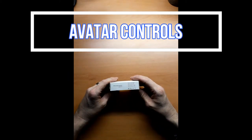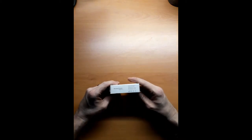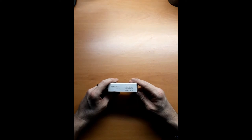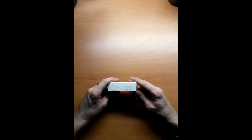So here we go. This is a Wi-Fi smart switch model T110, like I said. It has a power AC 90 volts to 250 volts, so it's smart on the inside too. It adjusts for whatever you plug it into, so you can wire it for 120, well 90, up to 250 volts, so that's pretty handy. Like I said, it also has a 10 amp maximum load. Wi-Fi is your 802.11 B, G, and N, and the radio frequency of 2.4G. So yeah, let's get right to it.